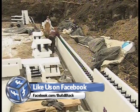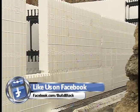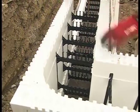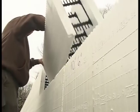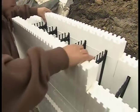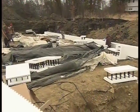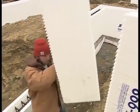Pretty quick. We do have to put rebar in and brace them, but otherwise it goes pretty well. Each ICF is over five square feet of surface area, so you get a lot of that wall built rather quickly. It's nice to have some of the corner pieces too — yep, pre-made corners, 45s, and brick ledges help out a lot. For the frost wall we're only going up to the height of the basement floor, right? We're going up to the bottom of the concrete floor of the basement.